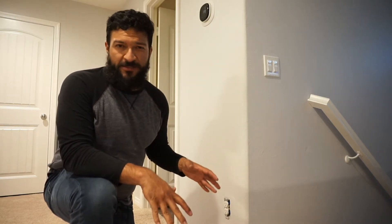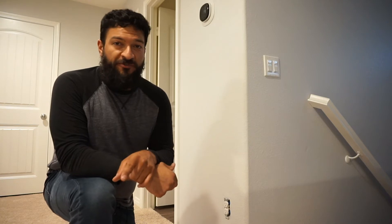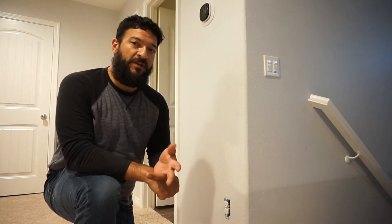So here's the AC table. Go to the row for less than 50 volts and over to the Restricted Approach Boundary column, and you'll see it says 'not specified.' That's interesting to me, because it doesn't say 'not required' — it says 'not specified.' We'll dive into that more over on What Up Sparky, but for right now it's not specified. If you go from 50 to 150 volts, it says 'avoid contact.'